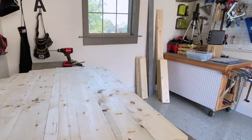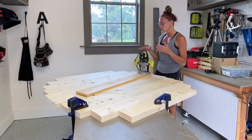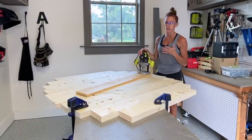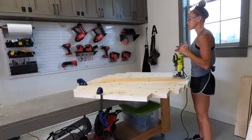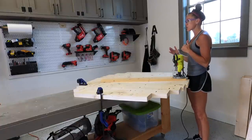So I've got the entire tabletop planked, and now it's time to cut my circle. To do that, I always use this jig for my router that I built myself. It's super easy. We've got the plans and the how-to for it on our website, and I'll add that in the description box below. But this one will do a table up to 60 inches wide.